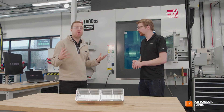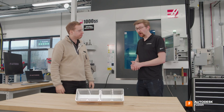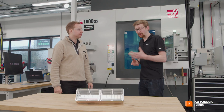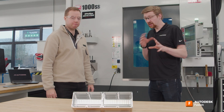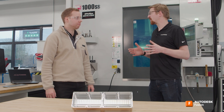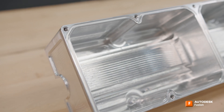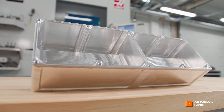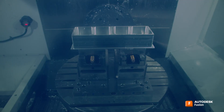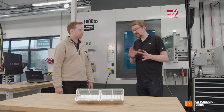We're quite fortunate here at the Autodesk PAS Technology Centre in the UK - we've got a bunch of different CNC machines we could have chosen. Looking at the part size, that ruled out a few machines that would not have fitted comfortably on the bed - I didn't want it to be right at the limit for your first ever foray into machining. Thinking about the features, we could have probably done this on a three-axis machine with lots of setups rather than multi-axis. But with Fusion it really makes it easy, so I made the decision to put it on a five-axis machine tool - that should actually be easier to do this in one hit rather than lots of different setups.